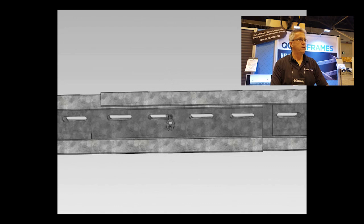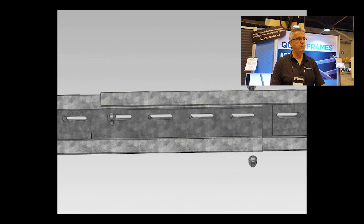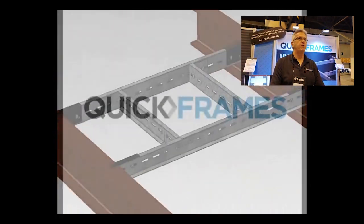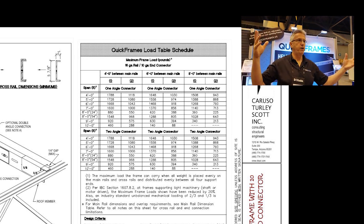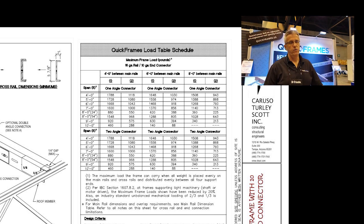If you look at the total cost envelope, which includes the metal, the fabrication time, the detailing time, the cost to take frames that are fully assembled and deliver them out on the site — because typically that takes a lot more trailers and tractors — the install time, and in particular the time that is almost always neglected: the rework time, whether it's coordination issues or change orders because a new tenant moves in, things have to move and relocate. Fabricators are finding there's a tremendous hidden cost in the change process and especially in the lack of coordination because trades are never hired early.